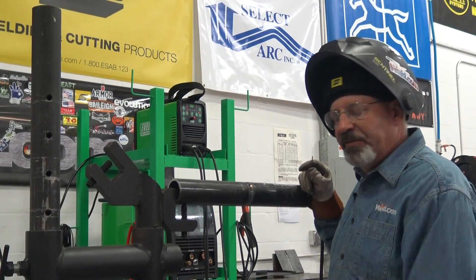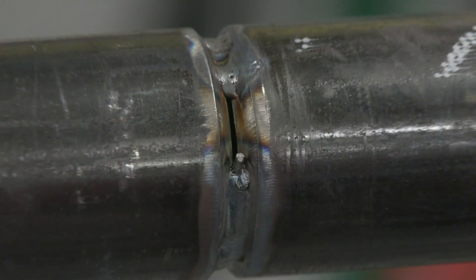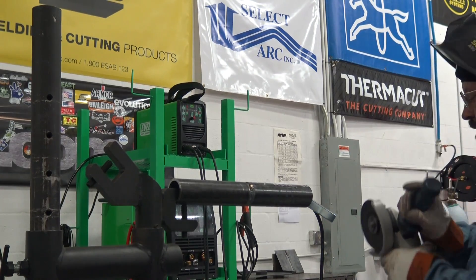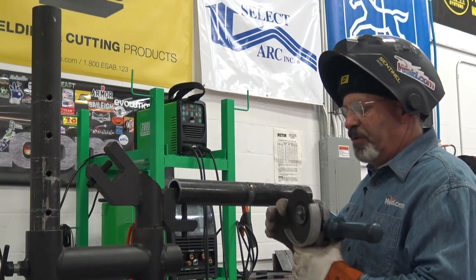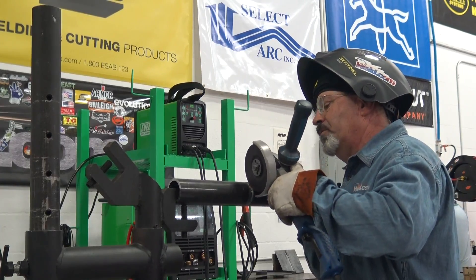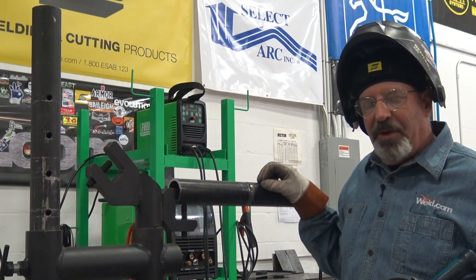Stuck my tungsten. Here's screw-up number one — how do you fix it? I had my wire stuck there so I just stopped and broke the arc. Now I'm gonna come in here with a cutoff wheel that's designed to do this kind of work. I have a very tight gap, so I'm gonna lightly clean this mess up that I made and feather this back a little bit. I'm also gonna take care of my start on my tack, and then I'll have this prep and hopefully we can save it. Again, it's a common mistake.